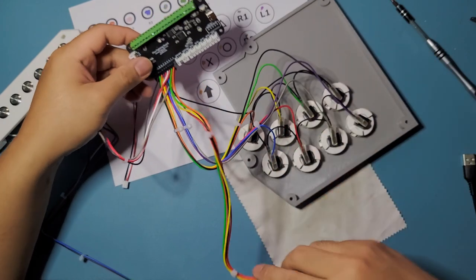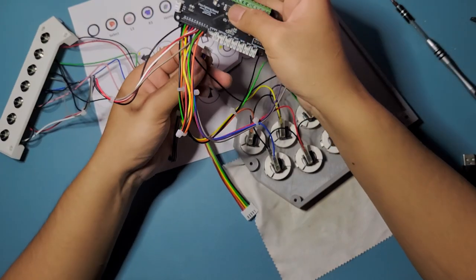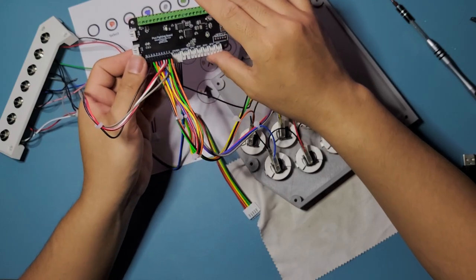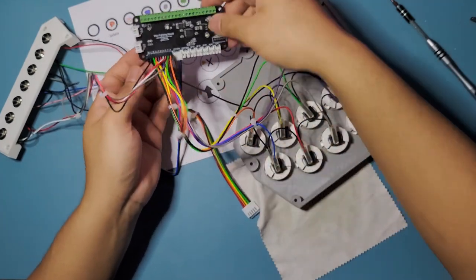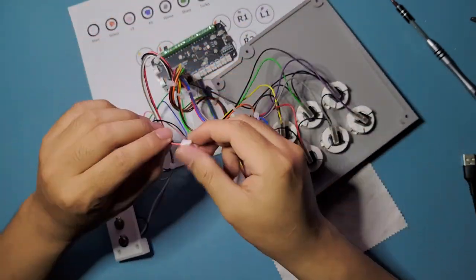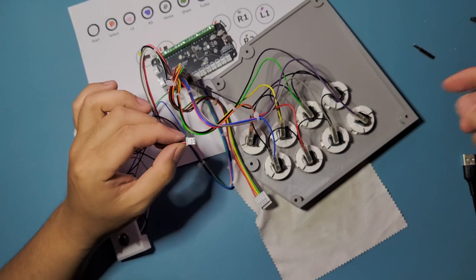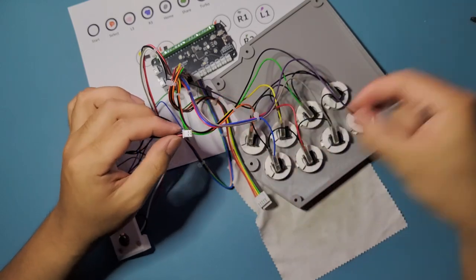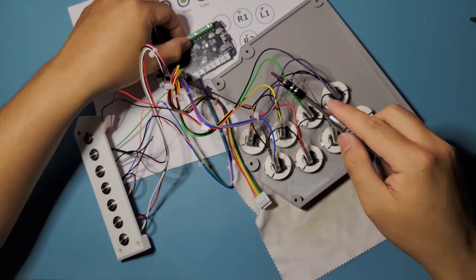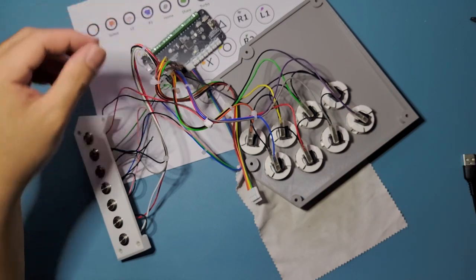And now we can wire up this side right here, which is going in right beside it. You just pop that in like so. Yep, and then that's it. Also, it's going to be for our turbo key right here. Now we're going to modify this one. I'm not sure if you're going to be using the same thing; you might be using just another set of wires. But I like to use this one because it has these metal ends that I can pull out and crimp just a little bit, and we're going to squish it down in between the side walls of these ones right here, and that's going to be enough for the contacts.